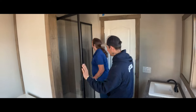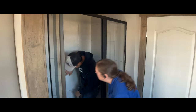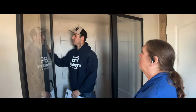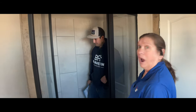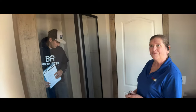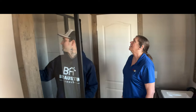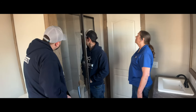The tile looks to be in good shape. We want to look at the grout lines carefully, because if there are any cracks those leave an area for water to get through. You know, it's usually that fiberglass. This one looks in really good shape — I don't see any imperfections.